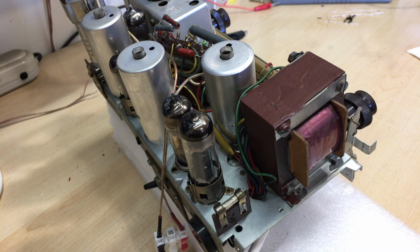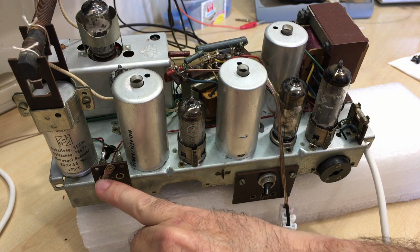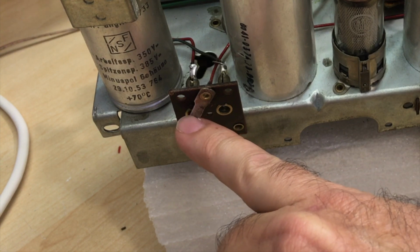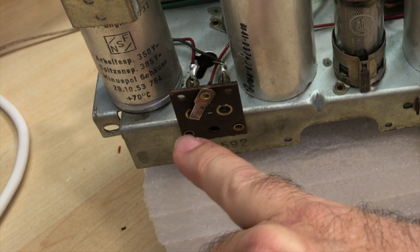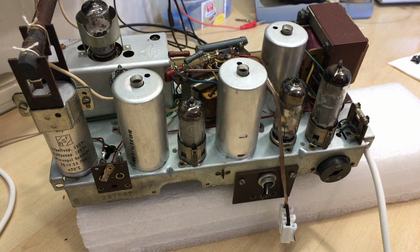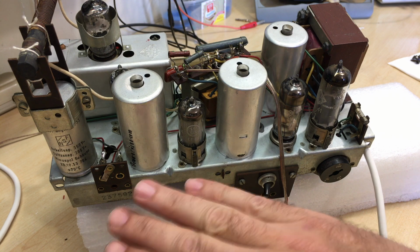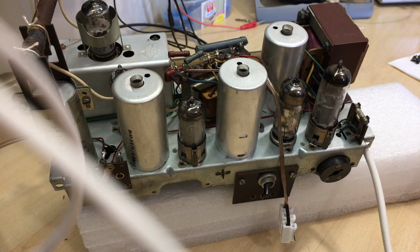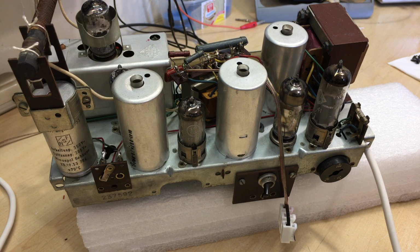As regards everything else, that little pin over there that goes to that, I think it's a 50 picofarad capacitor to the mains, touching one of the antenna inputs, actually works very well. And the way you see it works very well is when you just use that with no other antenna and you flip around with the mains cord, lift it higher and lower, make it horizontal, etc., you can actually tell the difference in reception. And it receives pretty well. It's probably as good or better than the internal dipoles that some of the bigger radios have.